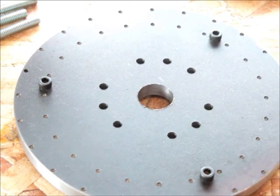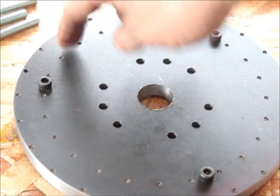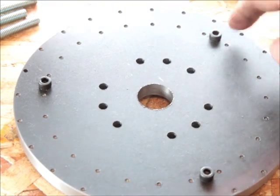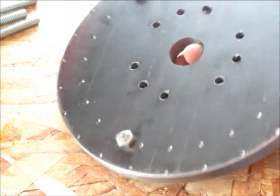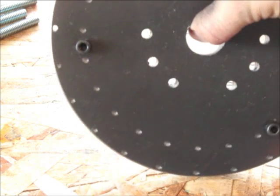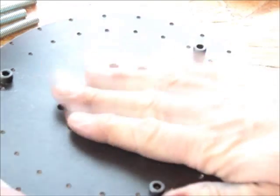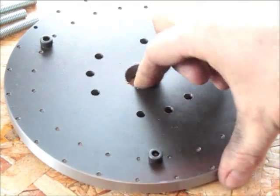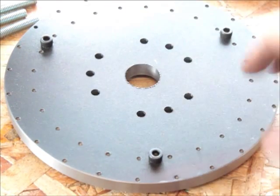Now I know more or less where I'm going to stop on the edge of that circle. The other thing about seven and six hundred and fifty thousandths diameter is the distance between these two holes — once you get out to the edge, on center is about exactly one inch. My 5C collet index has 24 stations, so they don't go all the way through — it's a very quick operation, great time savings. These are two plates bolted together and I've got that going through both sides. That one hole goes all the way through — that's how when I unbolt these two and put them around, they're the mirror image of each other. They are a pair, made together, and a set.